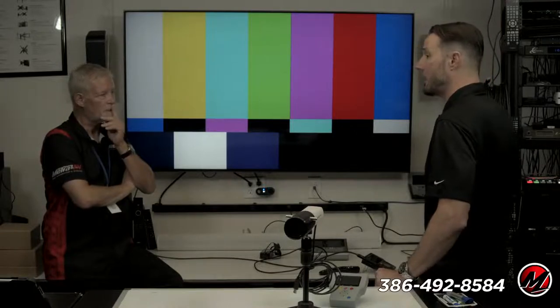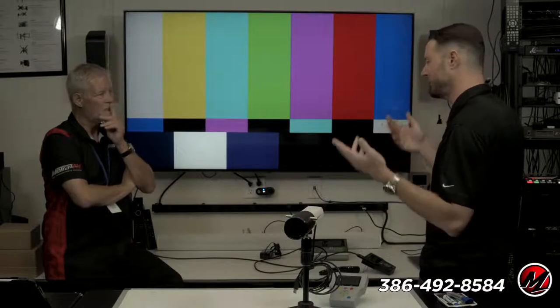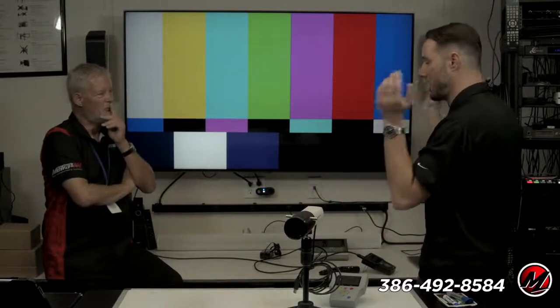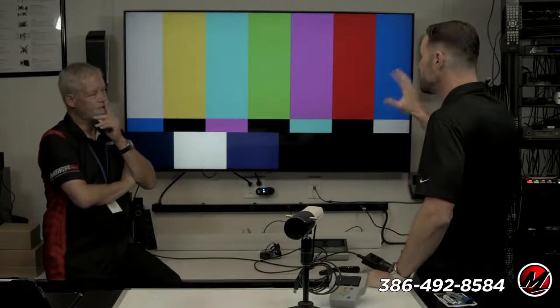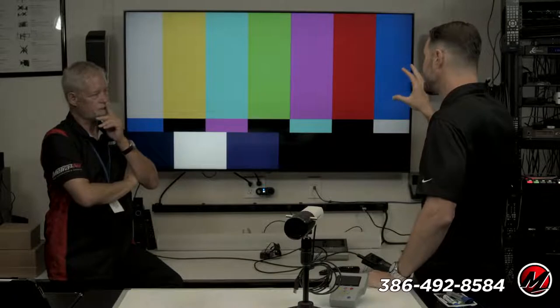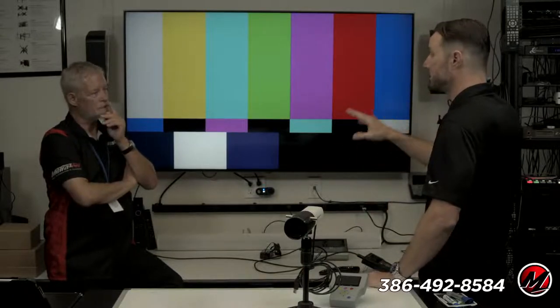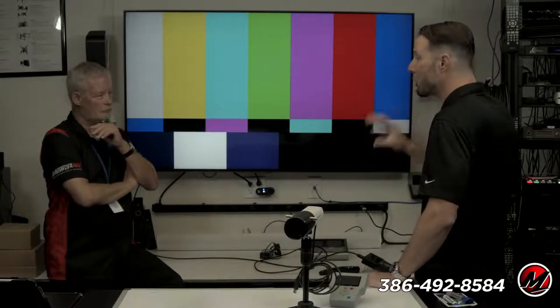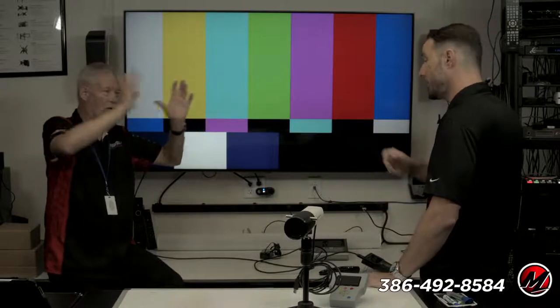But if you just do the math really quick, if you want to think about it in nits, off the top of my head, I just don't have it memorized, but it's 14 times 3.4, and that gives you how many nits it is. So if I take a 120-inch screen, and it's, let's say, 50 nits, same projector, same room, same screen, just smaller, I might be 80 nits. So the screen size is so incredibly important. Right, because the bigger the screen, the more the light's spread out, so the dimmer the picture.